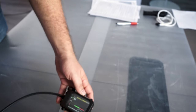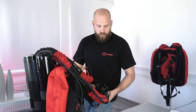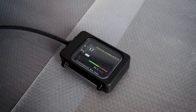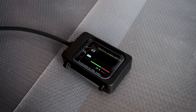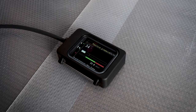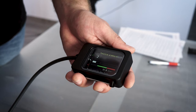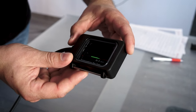For the positive pressure test I'll open the loop, and instead of evacuating it I'm going to blow into the loop. The countdown starts and we check what's happening with pressure within the loop. We started at around 24 millibar. The pressure within the loop is holding quite well. The countdown finishes and the pressure has barely dropped. I'm happy with this result and my pre-dive sequence is completed.